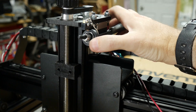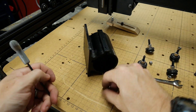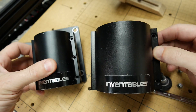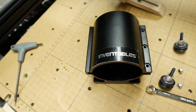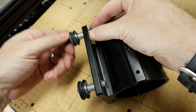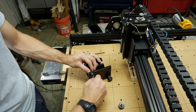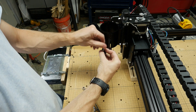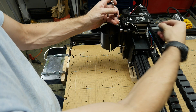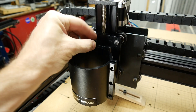These will all eventually have to come off to be transferred to the new mount for the larger spindle. So once those are all removed, you get the new spindle, which is quite a bit larger, and add all the V wheels back onto it. With those mounted on, you can slide it right back on, put the final V wheel on, and then attach it with the same two screws that you used on the previous mount.